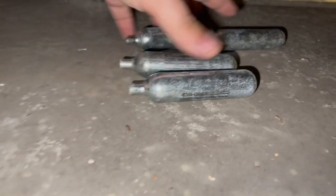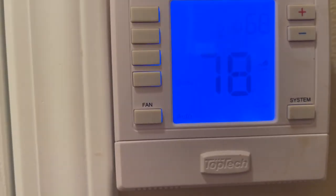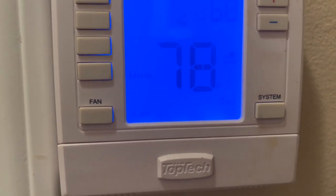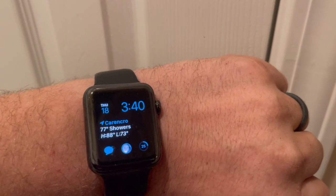I'm still waiting on the unit to come on. I really think she might have a bad thermostat. You can tell people have been unclogging the drain — there are CO2 cartridges. There's a battery, and looks like the breaker on the heat kit's been replaced. I don't have any tools with me, I just came up here, but that thing still hasn't come on. I'm going to go check the thermostat again. The snowflake is still blinking — I really think it's in time delay. It's 3:40. I'll give it another five minutes and if it hasn't come on yet, I'm going to take the thermostat off and jump it.